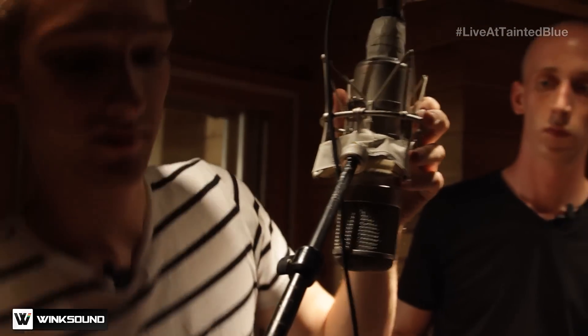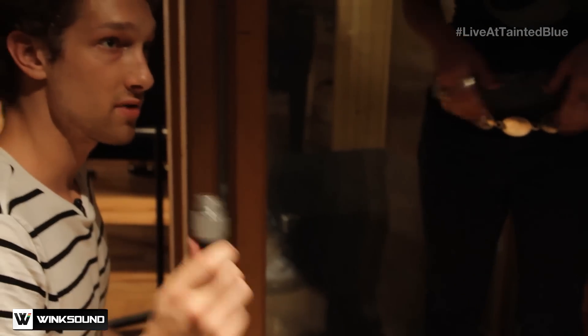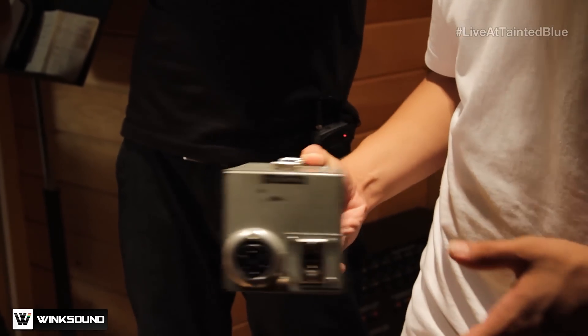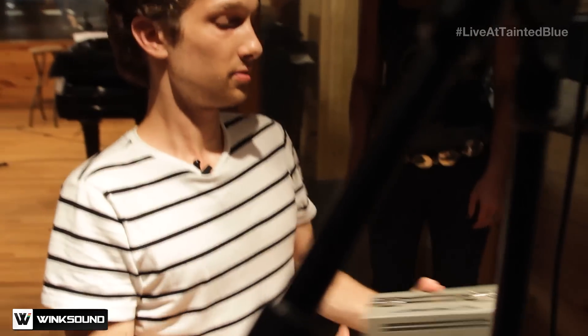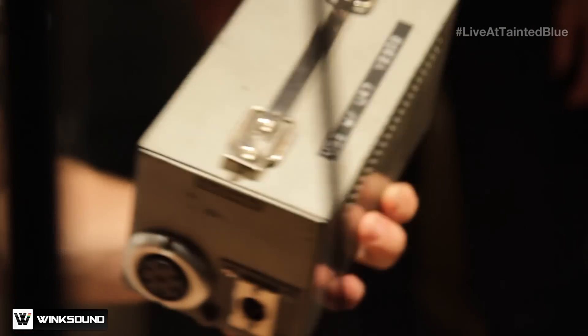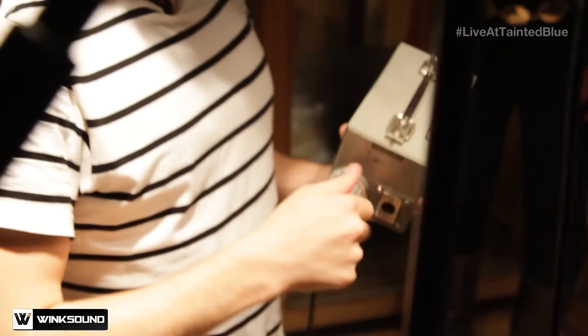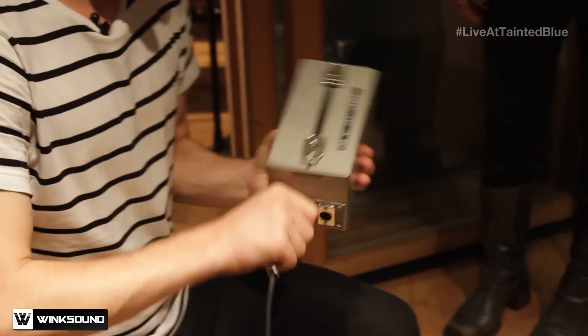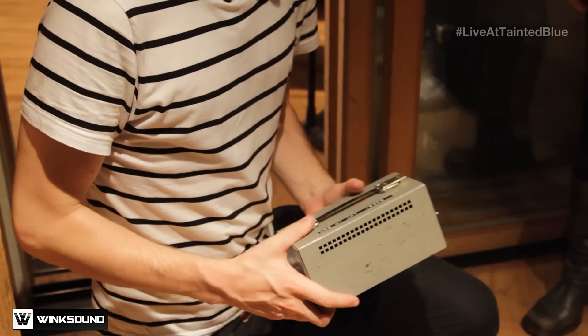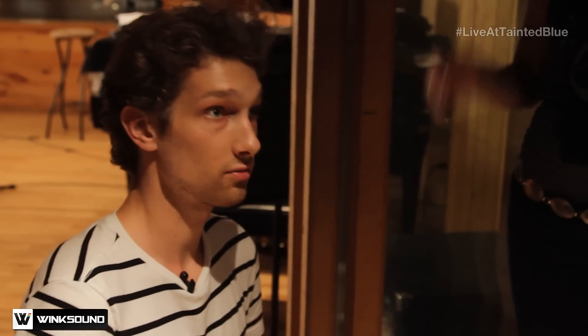Let's make sure that everything is very tight. On a tube mic, we need to make sure the mic is connected to the PSU — which is this unit — before we plug it in. If we have power applied to this box and then plug in the mic, we can potentially blow the vacuum tubes in the mic. So we hook it up like so, and we're okay to put this into the wall and turn it on because we've completed the chain under the microphone. We should let it heat up for about 15 minutes before we start recording, because after 15 minutes the fluctuations in the tube are going to settle down and it will be consistent throughout recording.